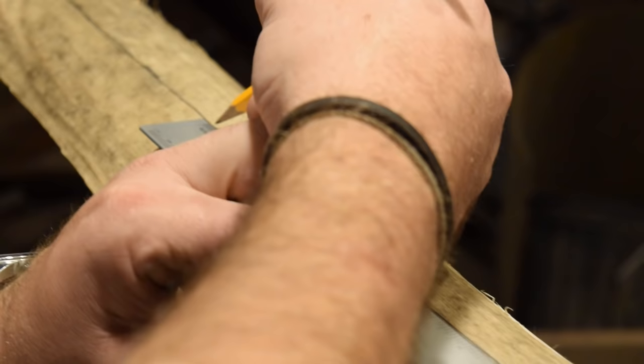Yeah, that's 50 pounds at 20 inches. That's looking good though. Definitely the top limb's working a little bit more, which is good because it's a little longer. And now I can really start to see where I need to make some adjustments. So I'll tiller some more, bring that down, but it's looking pretty good.